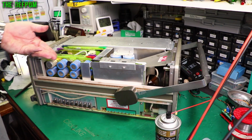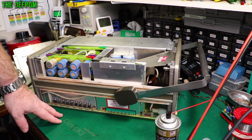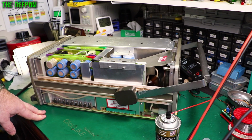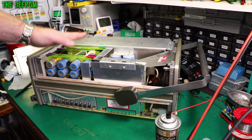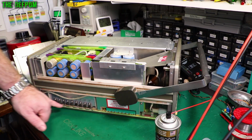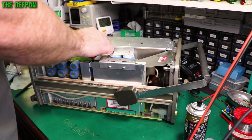So we've got 3 boards left, apart from the main logic board, the main motherboard I suppose, which does have some stuff on it, but not much. Obviously the main regulators and stuff here as well. Something I could do after I've done these power supply boards is some resistance measurements on the outputs of these regulators and check for any shorts. Could potentially do that.